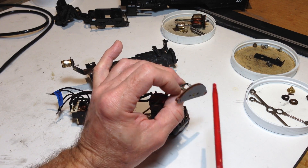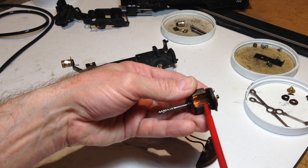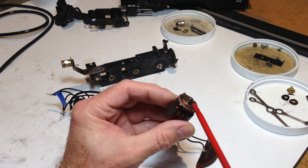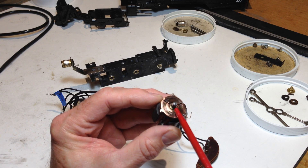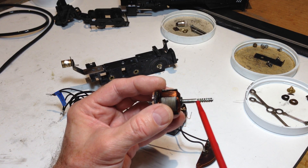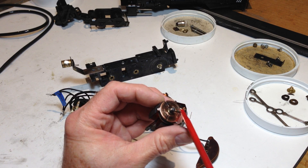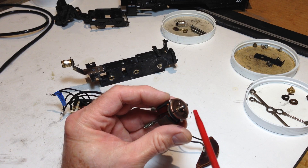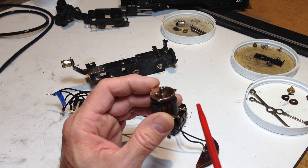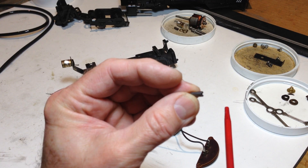You have the same need to make sure these are of the proper tension to position the brush correctly, that the passages for the brushes are clean, and that the rear armature bearing is not worn out or loose in the housing. This is the connector or plug board that goes in the back of the cab near its roof line, and the two plugs from the tender connect into it. The armature is of an earlier type — you can see how wide the segments are from each other, whereas later types had much closer segments. There is no oil splash guard on the back, so you don't put a washer there or it can rest between segments and cause shorting.